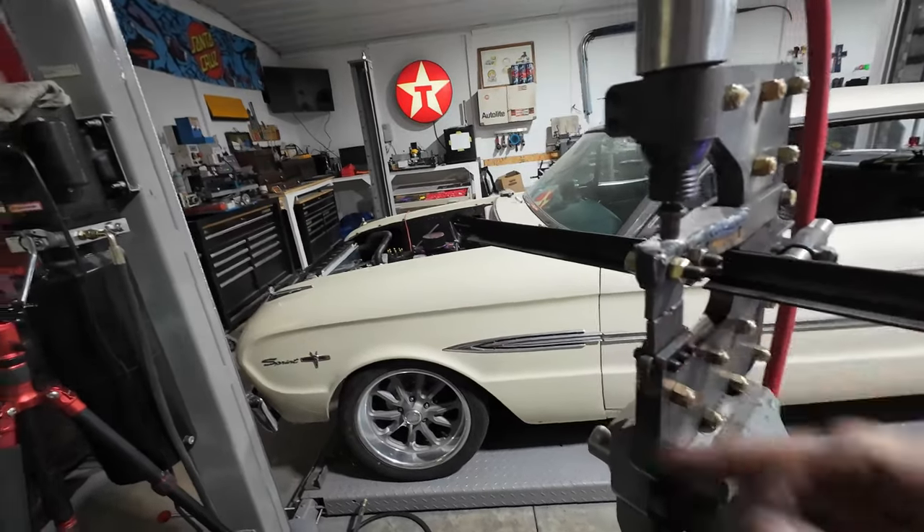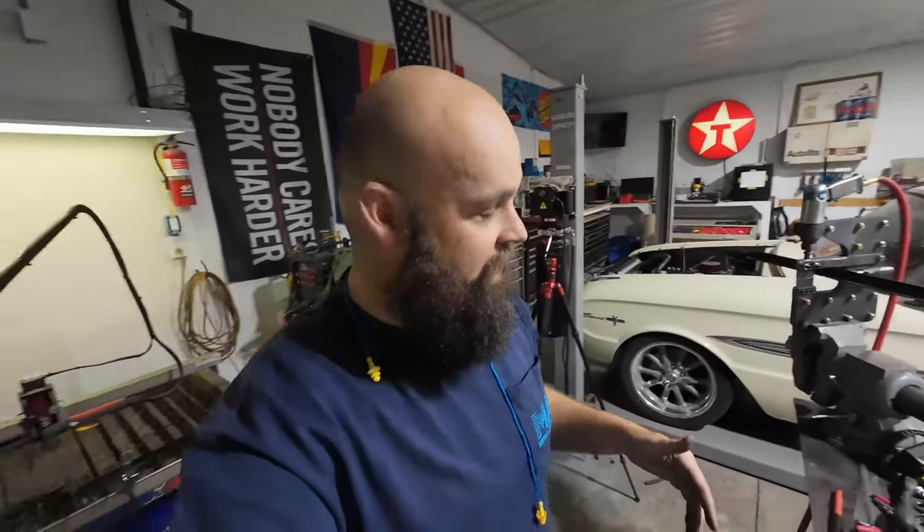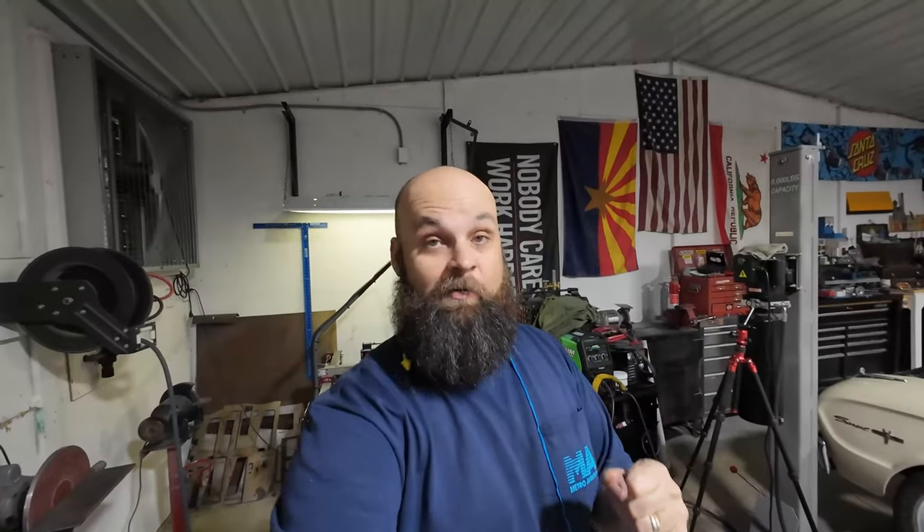Let's not talk too much about my welds because I'm not a welder — I'm just a guy with a welder. It started to crack in here and I hit Carl up and he said: grind that out, V-groove it, and then put some hot weld in there. I kind of had a sheet metal weld on there, like 80-90 amps, but I burned this one in at about 150 amps and it was hot. Anyways guys, we got it finished up — there's the fence for the Japhands Kustoms profiling tool. It works great. If you've got any input or things I could do different to make it better, drop it down there in the comments — I would love to hear it.